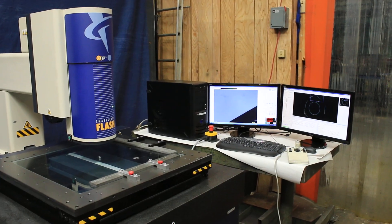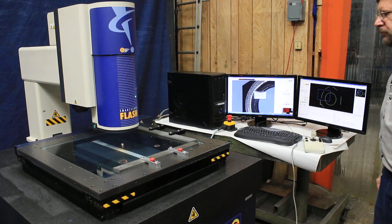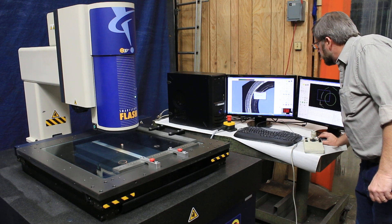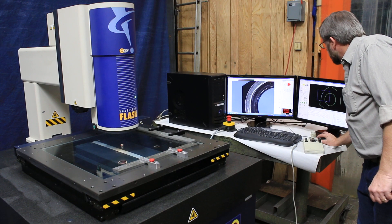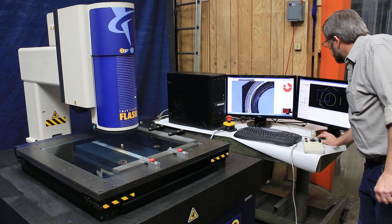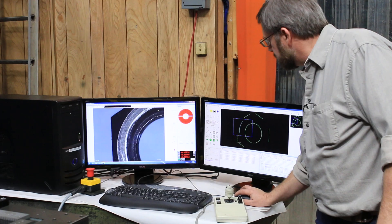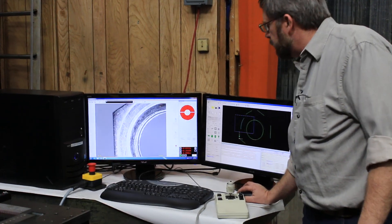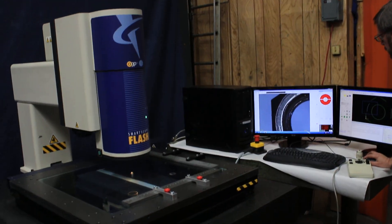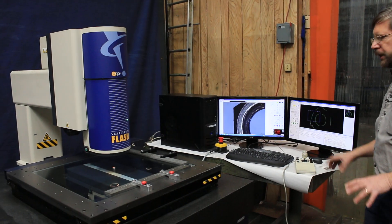The system has both backlight, top light, ring light, and through-the-lens lighting, and also a multi-ring LED light which has the ability to be adjusted for all of the different sectors and rings available. All of this can be adjusted as needed to be part of the measuring program. When you run the routine, the software will remember all of the different changes in the lighting.